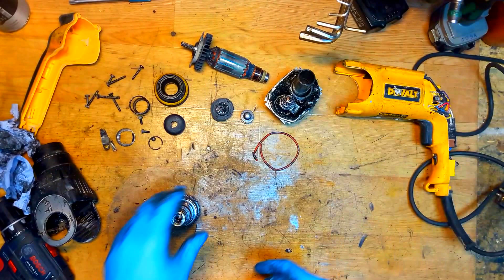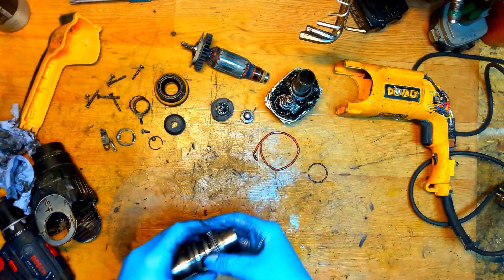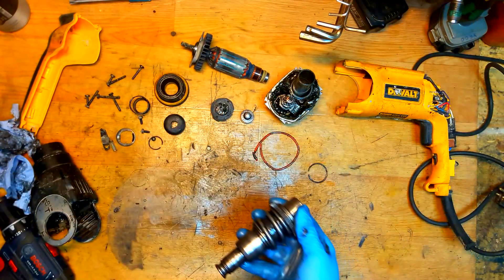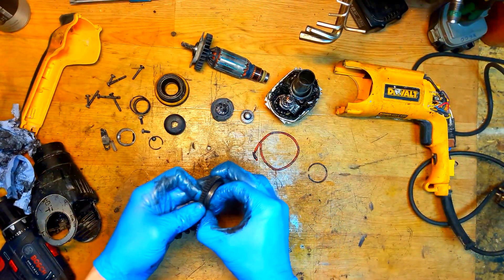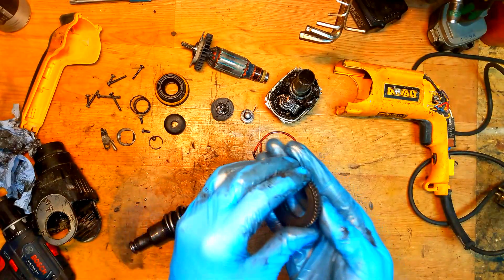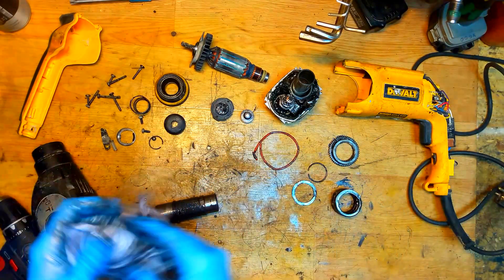I'm back. What I did is press the gear down and then release the ring. You can do that with something similar but bigger, or if you have a strong friend. It's a clutch here - it looks good. The spring and flat washer - it's a really, really hard spring here.